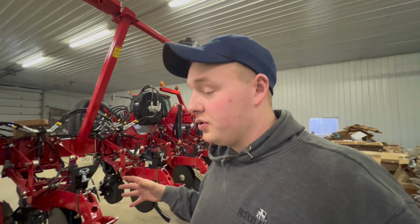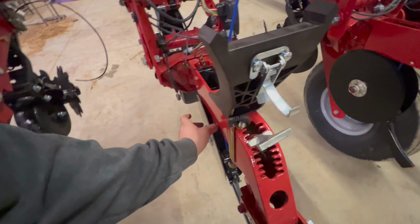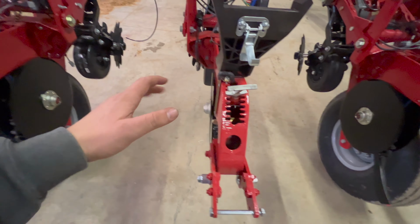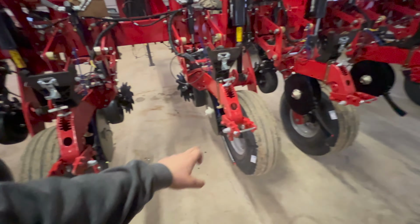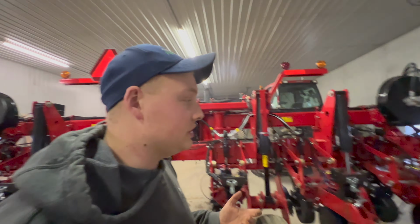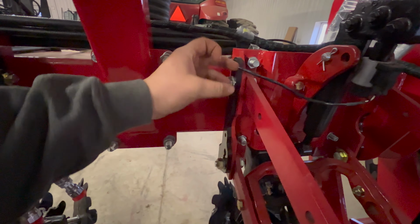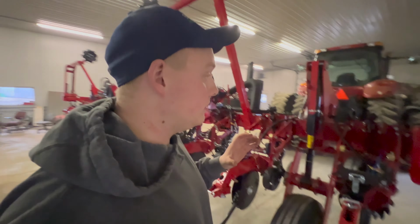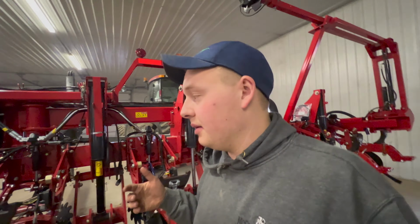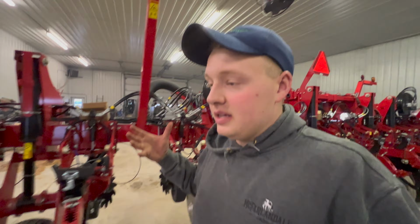They are going to get worn through. Some of them are the slightest little bit warped. You can tell when you run the blades together, but they're not super bad. Blades were the same as the parallel arms, it was GVGI. Also with the parallel arms, the reason we went with these is there's a replaceable bushing in there, and a piece of rubber padding also in there. So it is not wearing out the actual parallel arm itself. Once that goes bad, you can just replace it and you're not hurting the parallel arm itself.